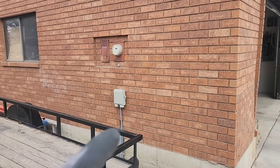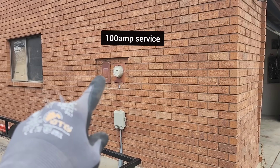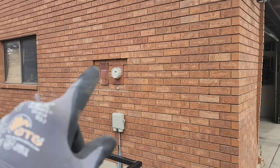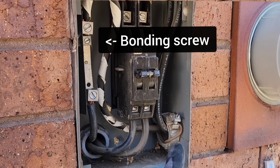If you're an electrician, there might be an easier way — feel free to comment on good ways to locate this stuff. Here in the United States, they want you to have your ground neutral bond at your main service disconnect. My main service disconnect is right here in the box next to my meter, but your main disconnect might be in your electrical panel. When I opened that box, I noticed there's no ground neutral bond in that box.